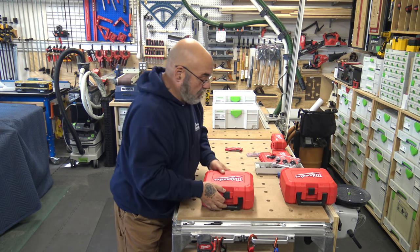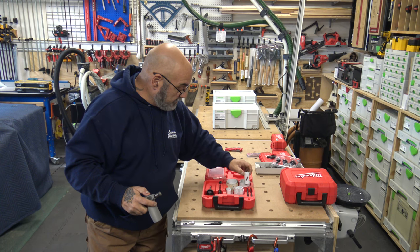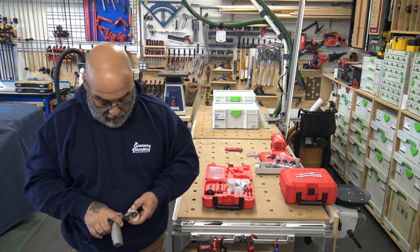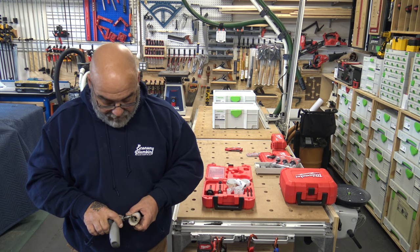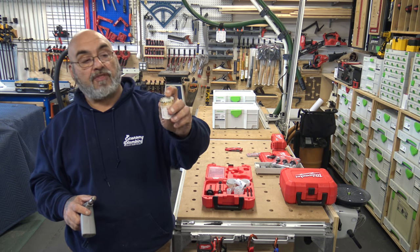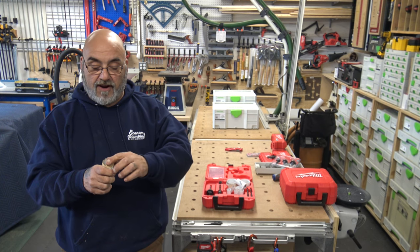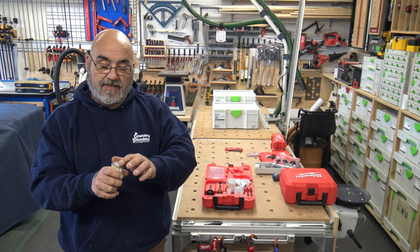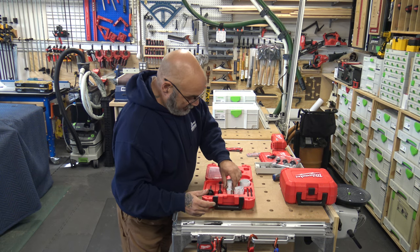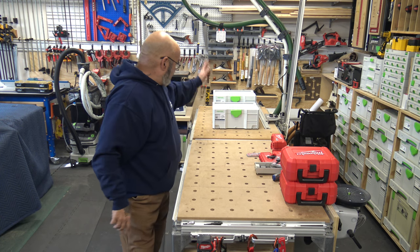Here's a quick little trick: I take a cordless Dremel with an inexpensive wire wheel and when we're done at the shop, I use the wire wheel to clean out the teeth instead of a file or something sharp. The wire wheel won't dull your bit but will clean it out. Also, to test if a hole saw is still sharp, don't rake your finger — just run it gently across the top of the bit. If it snags your skin, the bit is still sharp.